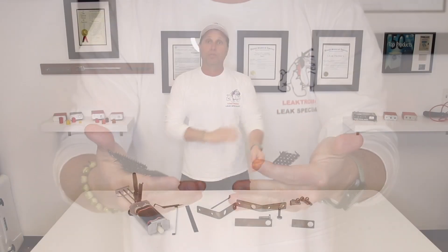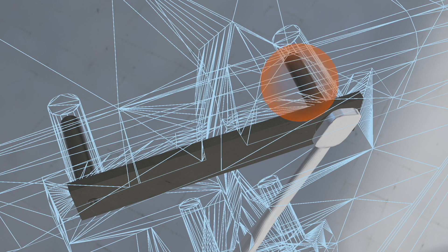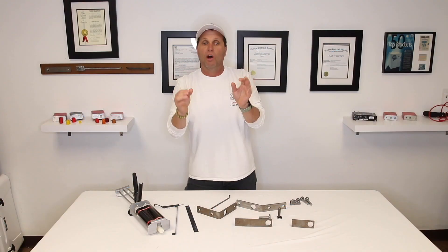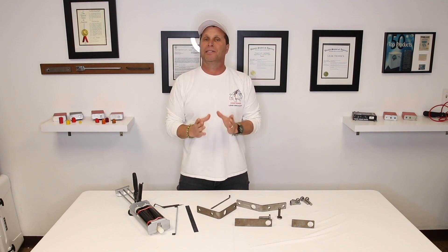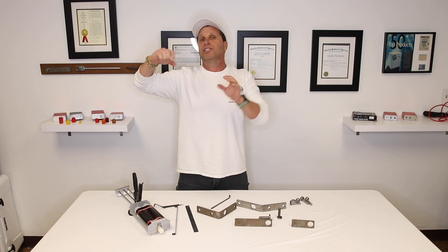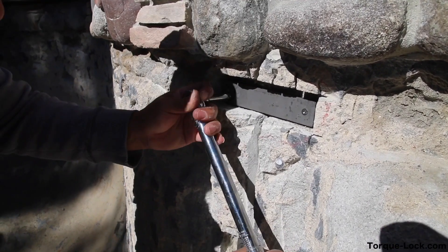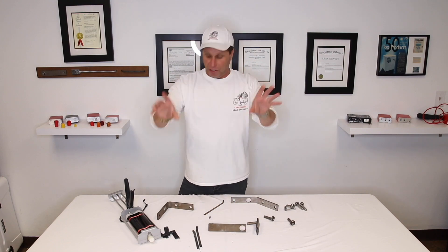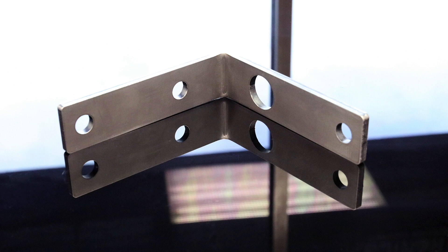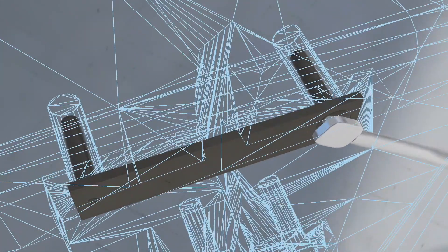What does work are post-tension staples — Torque Lock post-tension staples. They're the only controlled post-tension staple on the market. You literally set these into a wall and countersink them so that they can be plastered over, tiled over, or whatever you're going to do. You can control the amount of compression between the two pins using a torque wrench and achieving a certain torque, actually pulling these pins together and creating a controlled compression, so you're going to get a lot less failure. We have repair products for flat surfaces, 90-degree radiuses, and 45-degree radiuses, where we can put our cam in and control the compression between either side of the crack.